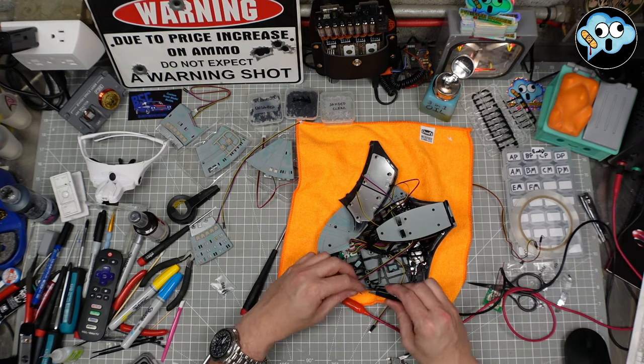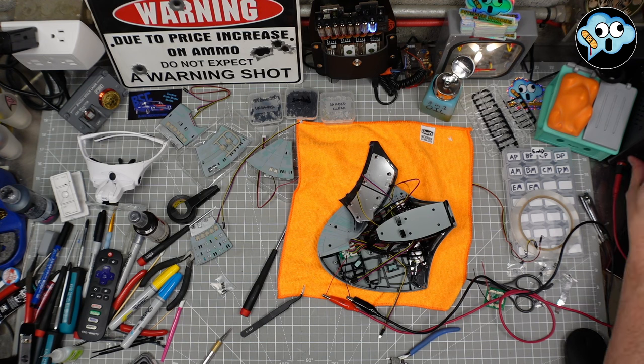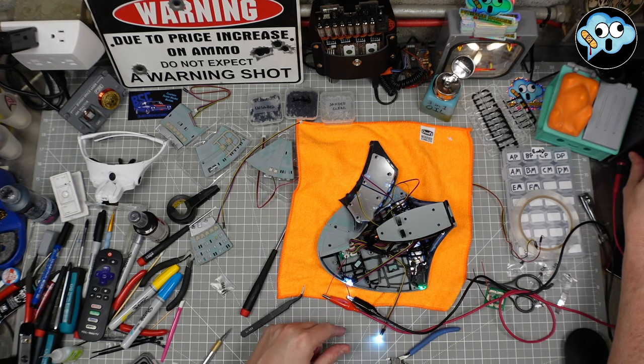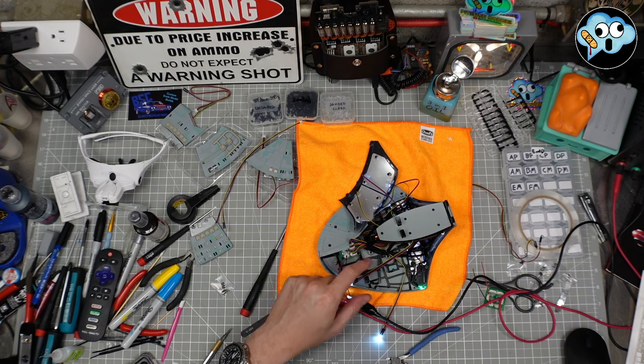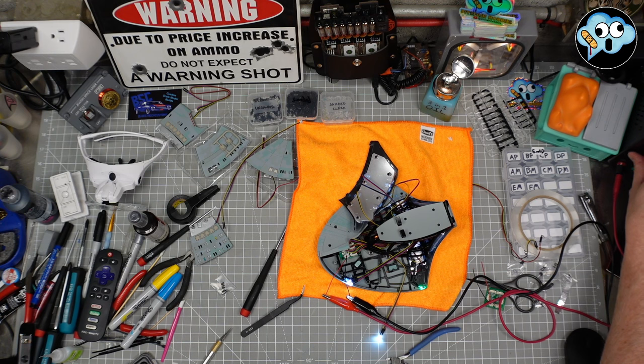Set it volts. 4.5 to 5 is fine. The board is self-resistored, so I just run everything at 5. And good. All these turn on, all our other stuff turned on. Okay, photon burritos lit up. Good, great. It turns off quick. How much amperage is this thing sucking? Let's see. 1/4 amp so far. And there might be one more light to add to this next section. 1/4 frickin' amp. Okay, yeah. That thing will eat AAA batteries quickly, whatever size it was. We're gonna come up with a solution for that. I'll be back shortly.